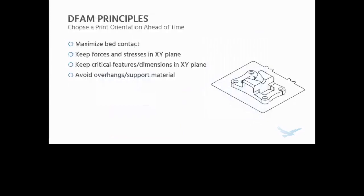And then in addition to the other material choices with the X7, you do get a larger build volume. You get a laser micrometer on the print head for assisted bed leveling, adaptive printing, and actually inspection functionality. And my moderator is going to be doing a presentation on that later today. You should definitely check that out if you're interested in learning more. It also has motor encoders for more accuracy, a webcam, 50 micron layer height, turbo print for faster printing, and some additional materials like we said before, namely for more regulated applications.